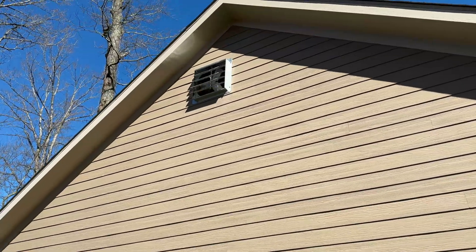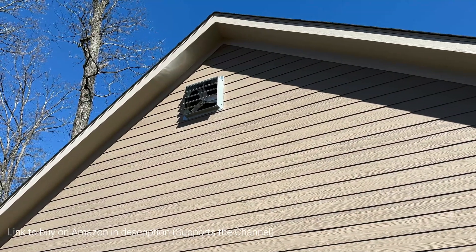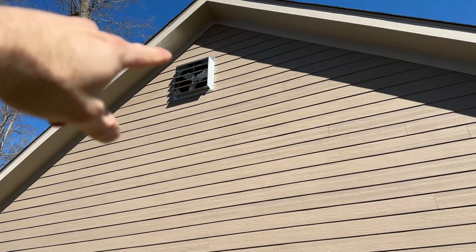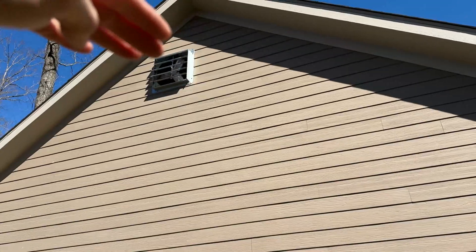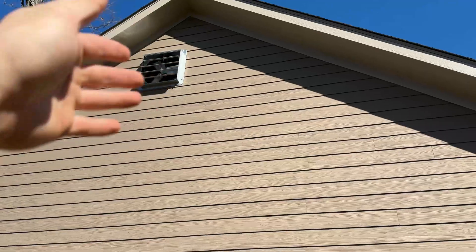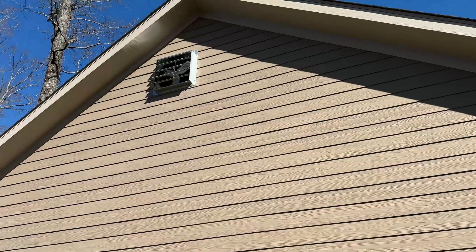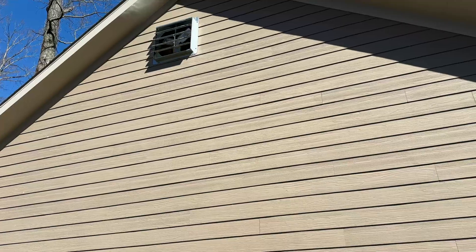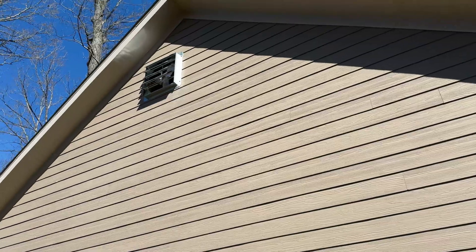The last leg of the tour is what I just finished up this morning: the exhaust fan. A 24-inch Ken Brown louvered exhaust fan, installed way up high — because everything is exhausting into the building, I wanted to pull the hottest possible air out from the top so it's replaced by cooler air moving up. It's skewed over to the left of the king stud, which allows me to add a second fan to the right if it gets too hot in summer. I installed an outlet up there since it's a plug-in model, and we could go double fans or even four-way if we really want to get into it.